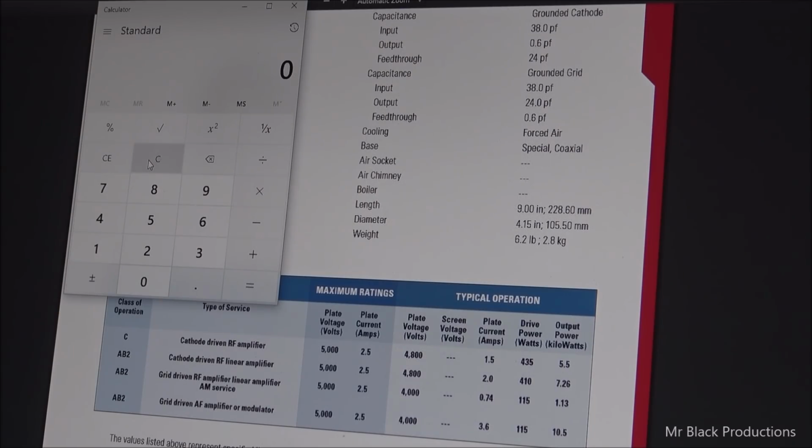Now if we're going to do a full wave rectification, which is what I'm going to do, it gives us a little bit less sag, and it's not going to put so much pressure on the transformer. I'm going to spec this for 6000 volts. Because as the transformer starts to load and becomes saturated, our actual output voltage of the transformer is going to sag. But we can compensate for this when we get it on the other end. I'm going to teach you this trick.